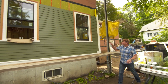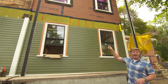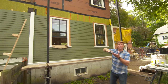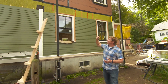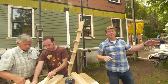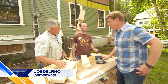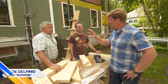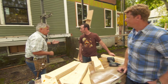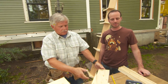The exterior of the house has clapboards on the first floor and shingles on the second floor. Architect Matt Cummings has called for a flare detail to separate the two, which will help break up the mass of the house — it's a detail seen throughout the neighborhood. Most people think of a flare starting at the bottom of the house where the shingles come out a little bit and roll up. Tommy has scrap pieces to demonstrate — you take a filler, cut a little wedge, and that brings the bottom row out even prouder.